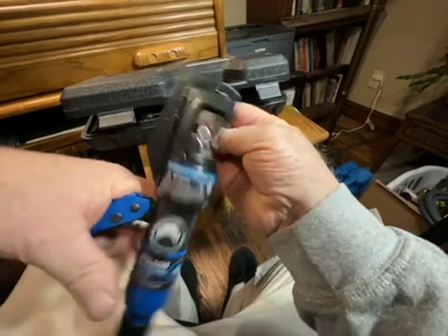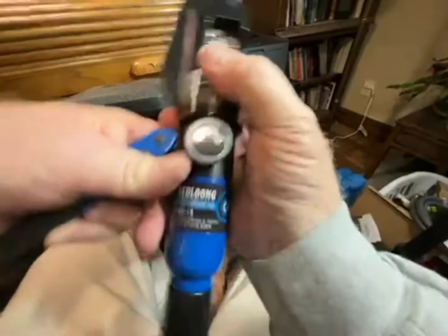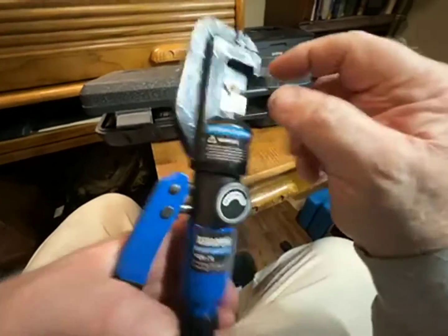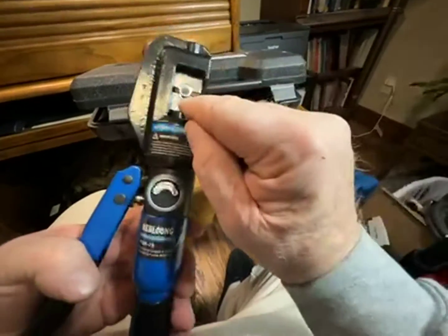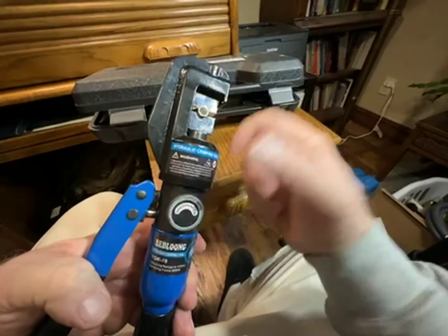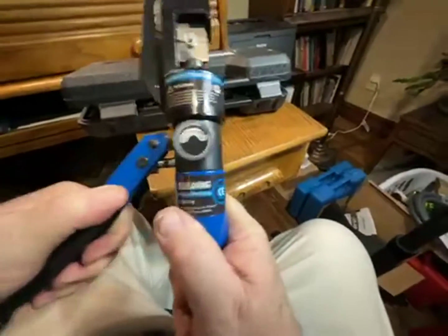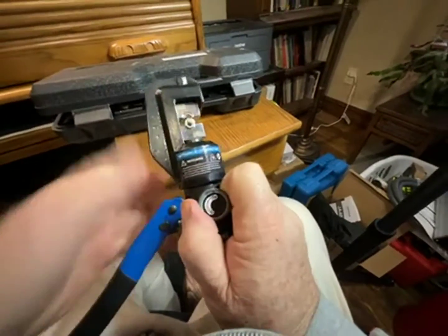And we put it in. And the trick to this is to pull it up till you've got it snug, like so. Then put your bare wire in there and make sure that it's all wire. It should be stripped to 1/2 inch. And go in there, and then just grab a hold and scrunch it down till it stops.